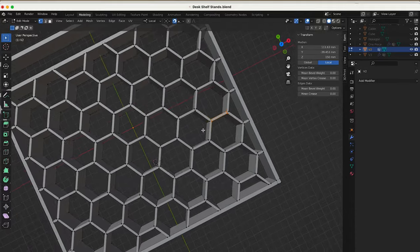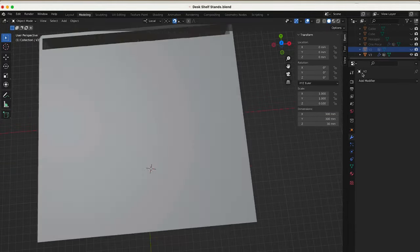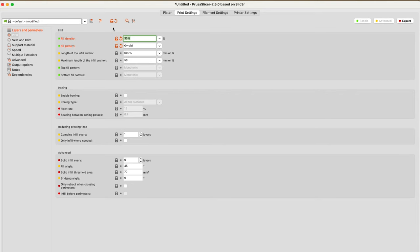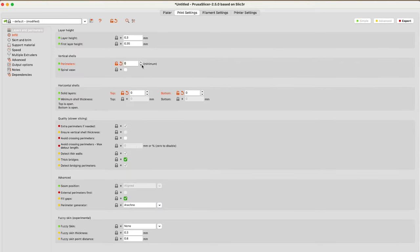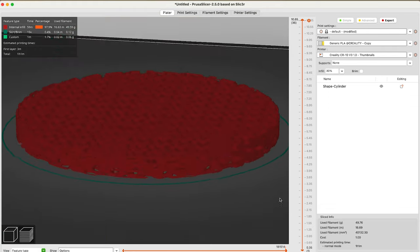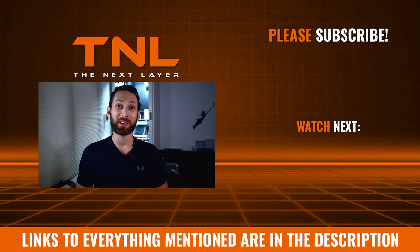The sky is the limit with this concept. Remember, you have a lot of different infill patterns and densities at your disposal, so play around with them. You can vary the number of perimeters to change the look of the border and how sturdy the print will be. You could even try printing with no top layers, no bottom layers, and no perimeters — for example, if you wanted to make a cushioning surface or just make a cool remix of a model that you like. I'd love to see what you all come up with, so share a link to the makes in the comments below.